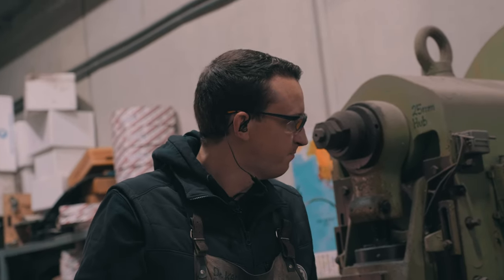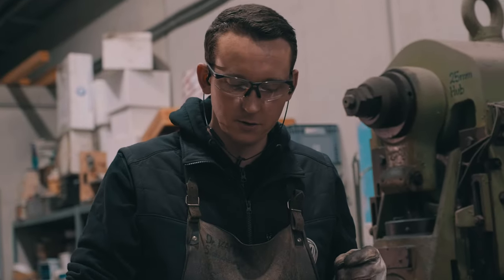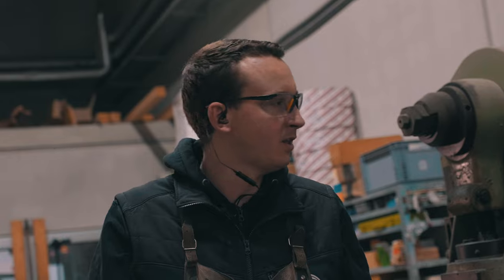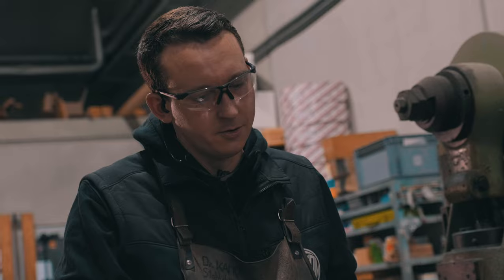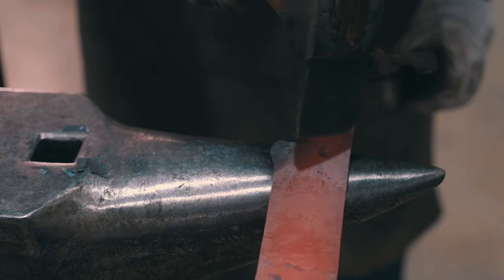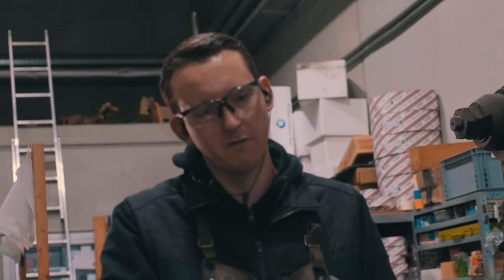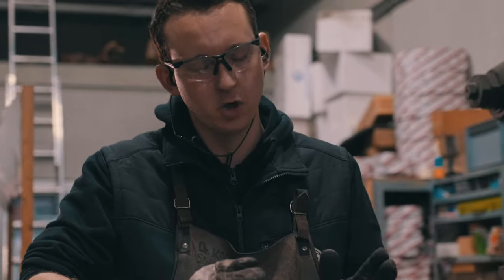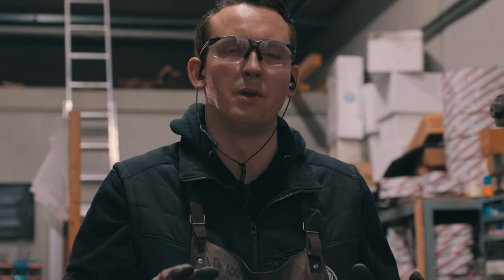Handle forging is done — at least the hot forging. Now I'll go to forge the blade. I'll start by drawing the choil out, because I find it easier to get to a certain blade height that way. Otherwise the choil will usually drop off. What you accomplish by forging it out first is that you set the height of the blade essentially, and then the choil only moves back once you forge the rest of the height of the blade.